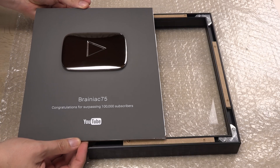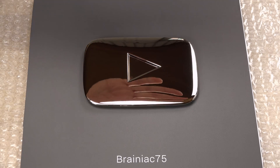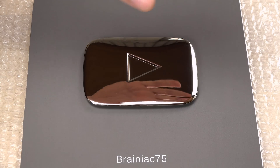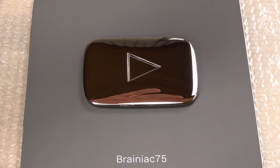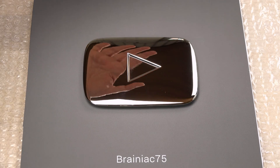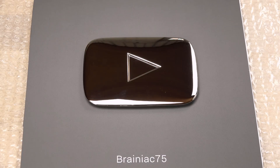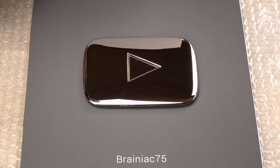Will a magnet stick to it? At first I was distracted by how shiny it is. Some say it is silver coated, but I doubt it. A chrome plating is easier, cheaper, more durable, and would be a better solution — so my guess is a chrome plating. Anyway, it is not solid silver. Let's see if the magnet gives us more clues to what material the button is made of.